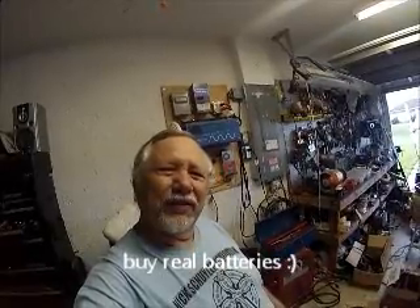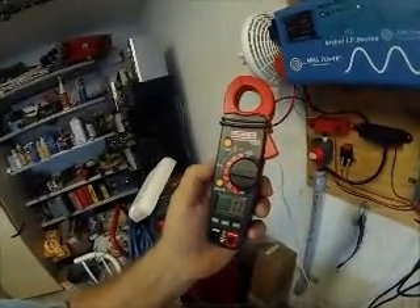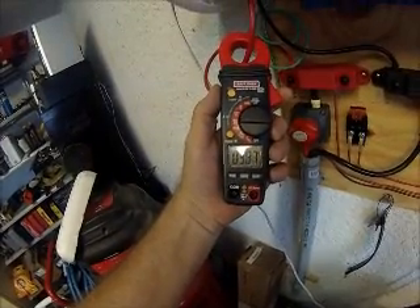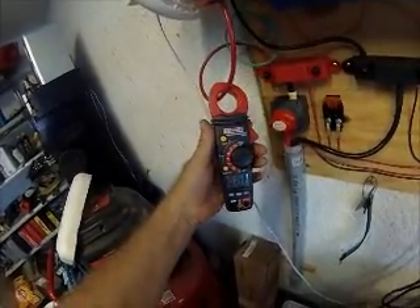The batteries are good for 1,060 minutes at 25 amps until they're dead. For 50% discharge that's about 530 minutes — not a lot at 25 amps. When my 25-cubic-foot refrigerator-freezer goes into defrost it pulls 11 amps, though most of the time during the day we're pulling four or five amps. Let's check right now with this handy Craftsman AC/DC clamp amp meter — they're cheap. We've got 3.8 amps, and the inverter takes 0.7 amps.